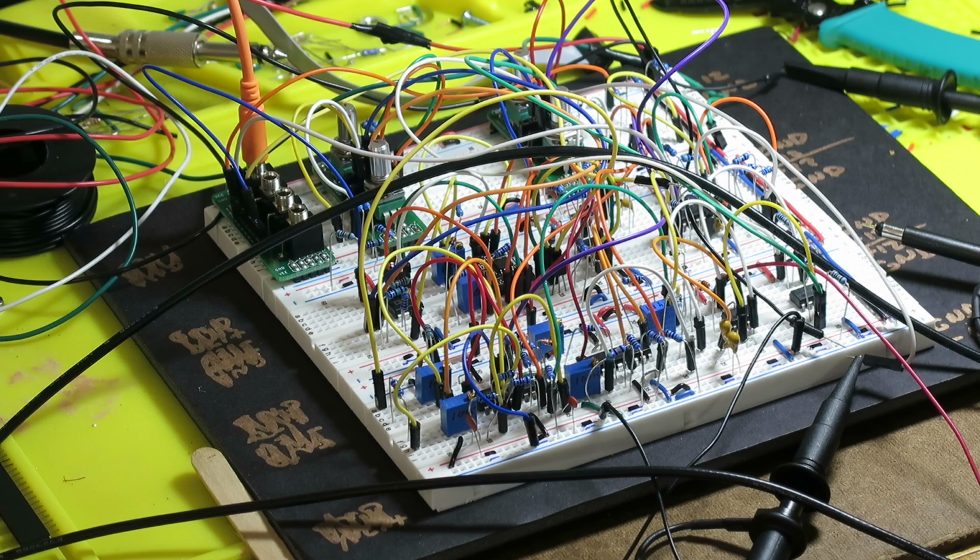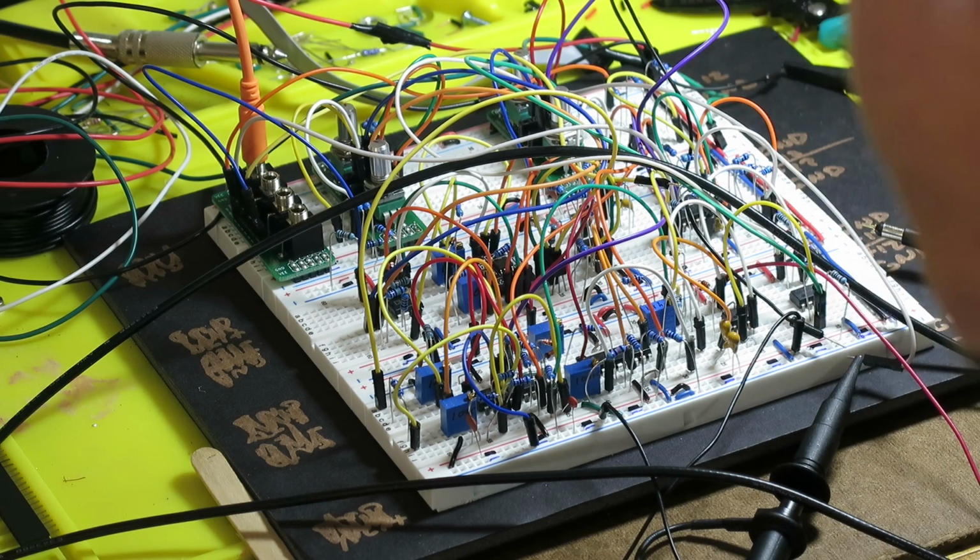It's certainly the cheapest way to do it, but Ray Wilson, who designed this thing, designed it to use a part which is the SSM2210, which is two transistors that are fabricated on the same piece of silicon, and then they're packaged up like an integrated circuit. And he used a through-hole version of that, the dual inline package version. But that part went out of production about a decade or so ago. And if you look around, you can find vendors that still have new old stock 2210s in the DIP format. And they'll be happy to sell them to you if you fork over an obscene amount of money for them.